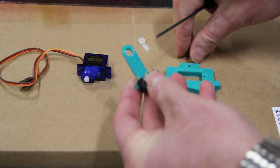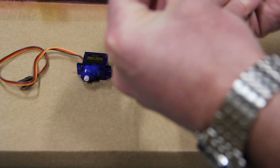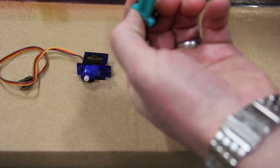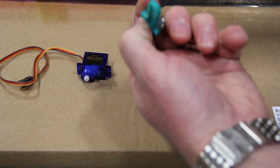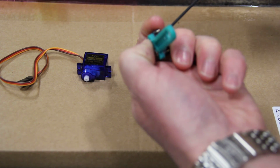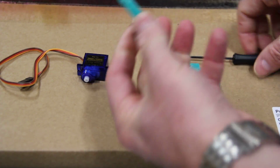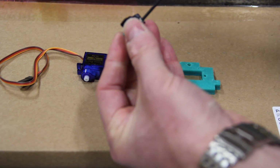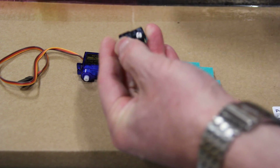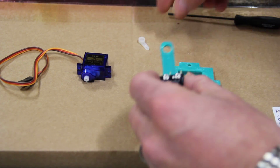Now, like I said, when I first did this, I actually just used the microswitch that was working currently as my Z end stop, and just moved the whole thing over, wires and all. For the sake of clarity right here, I'm not using a wired up setup, but I will assume that if you own this printer, then you built it from the kit. And if you built the printer from the kit, you're not going to be terribly intimidated by what is involved in wiring up a microswitch. So that's what we're looking for right there.